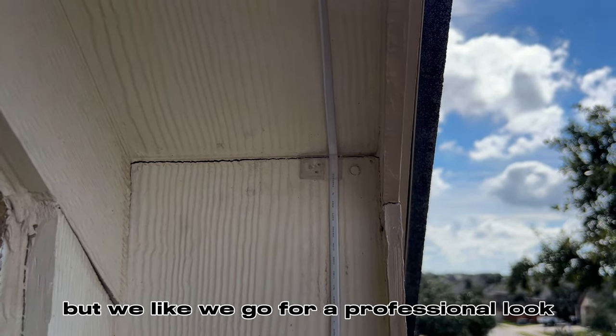On this side, here are the three lights, like I had mentioned. Take you up here so you can see. There's the three lights there. And like I had mentioned, if you just start with your male end, the three prongs here, you don't have to do any splicing. So we got a 12-foot extension that will run up here. Took it tight, gave it a clip, gave it another clip, run up the top here. And this 12-foot will go up, and then we'll start our lights here. So always try to start your male connections or your female connections at areas where you know you're going to use a 12-foot jump.